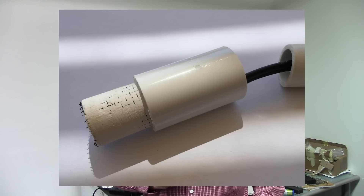I ran into these gypsum sensors that you can make from plaster of Paris. I made some and they started to rust real fast, within a few days. I figured out the electrodes need to be stainless steel, and then I found you cannot do that with DC measurements. You need alternating current, and the frequency and pulse length matter a lot as well. There was a lot of experimentation in that, but that was basically the first idea.